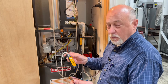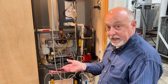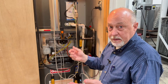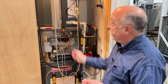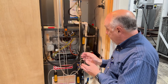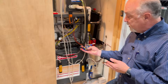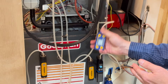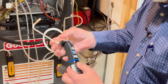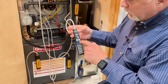Why would you have a single port? The simple answer is just to make it easier to manage hose. If you have two long hoses off a dual port it can be harder to manage, so they make a single port so you can put one down here and one up there and make it a little more flexible. We've also got manometers that have displays — like this little Yellow Jacket differential pressure manometer — and some like the JB which also has an integrated display.